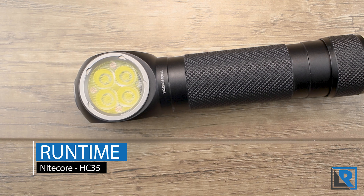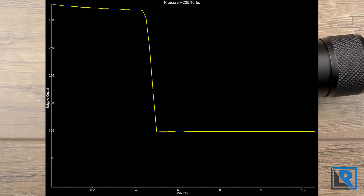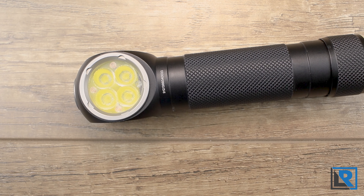I'm going to say the NICOR is more of a work light than a headlamp, just because of its size and broad beam. For runtime, this is really a light designed for longer outputs. Turbo starts decreasing at only the 30-second mark and then declines pretty rapidly down to high at 800 lumens — disappointing given the mass of this light. I would have hoped to get a couple minutes out of turbo. From there it mostly maintains while sagging a little out to the 140-minute mark, then over the next 20 minutes there are two large step-downs, and the light runs on low and ultra low for the remainder of the 475-minute total runtime. Low voltage protection kicks in at 2.947 volts.